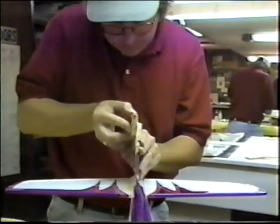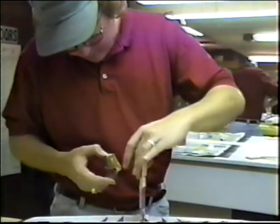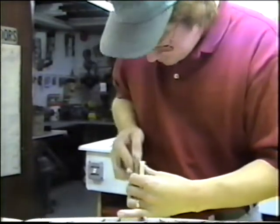Now I'll do the same operation, sand it, go over it again with the dowel, and then I'm going to hit this with that green putty. And just go slow. Now, what you could do, you put tape on the rudder. Yeah. Okay, put tape on the spot so you don't run the sandpaper and go little by little by little by little. Don't try to knock it all off in 2 minutes.